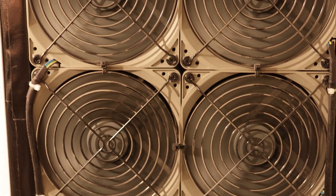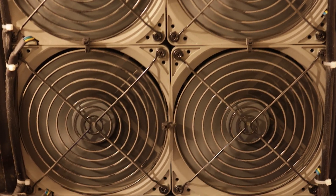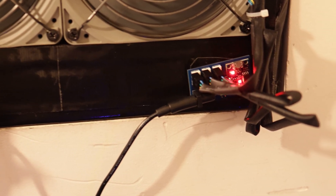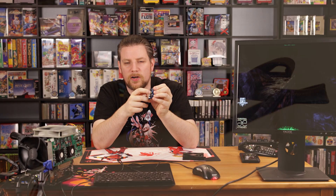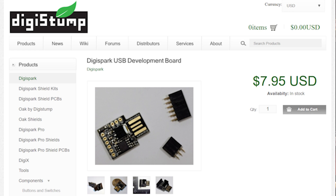The basics: we have DC 12-volt in via a standard barrel jack. I put three fan headers on it. In my particular setup there are two columns of three fans each, and each column is powered by a separate board intentionally, because those run on different battery backup UPS units — so if I lose one UPS I only lose half the fans. There are jumpers that control how much fan speed we want, making it configurable. And this entire other piece of the board is a DigiSpark — a pre-made board you can buy that turned out to have everything else I needed already built in.